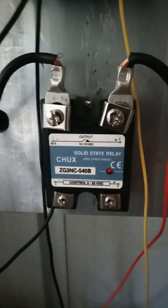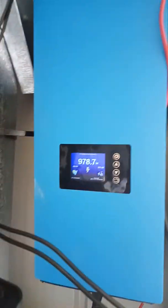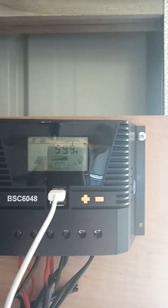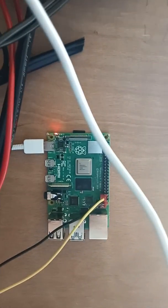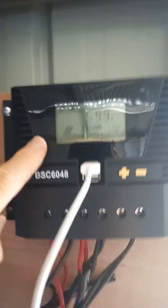I'll take you over to my other project. This is my other on-the-go project. This is where my 2kW inverter now is — it's hooked up to the solar panels on the roof. It's just 1.2kW. And I've got an MPPT as well. This currently is not charging anything — it's all wired up. There's a Raspberry Pi at the bottom there. That's controlling when I actually turn my batteries on to the inverter.